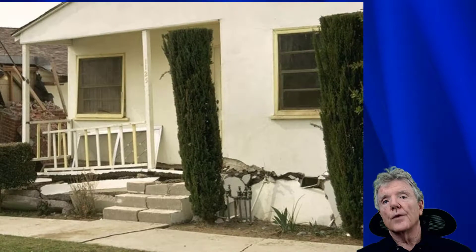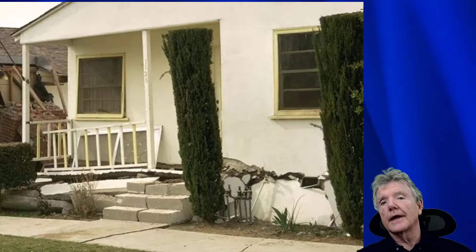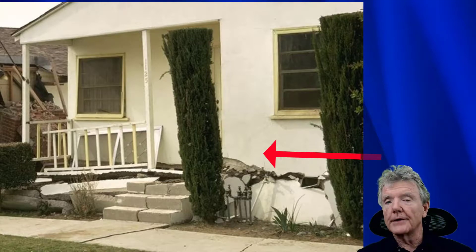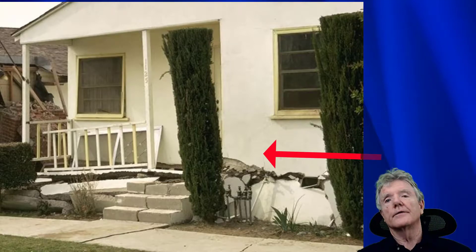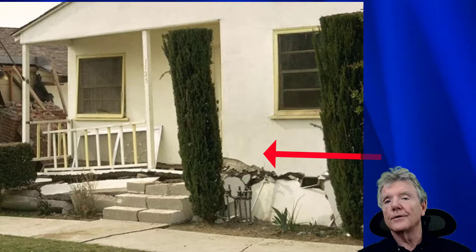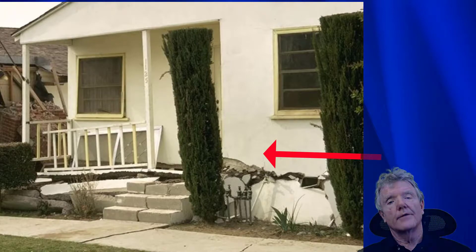This is another case where the fact that the end joist was attached to the mud sill with only three nails caused a catastrophic failure. So if the earthquake force went this way and tried to push the end joist off of the mud sill, it just slid right off. If you imagine there's 5,000 pounds of force trying to push on a house and there's only three nails holding it to the mud sill, it's going to fail like this every time.